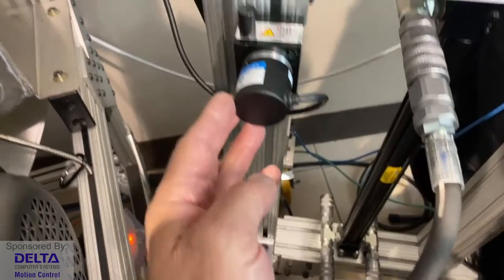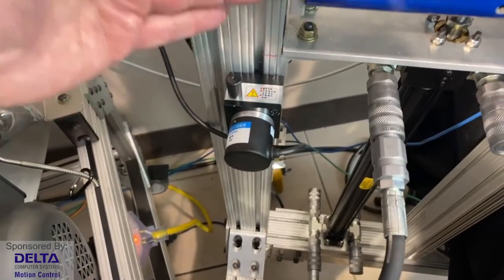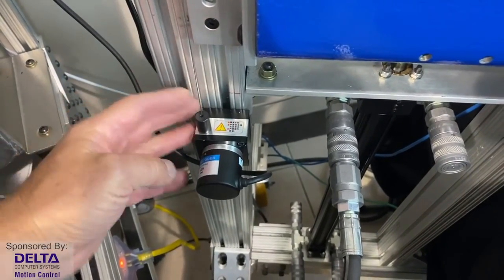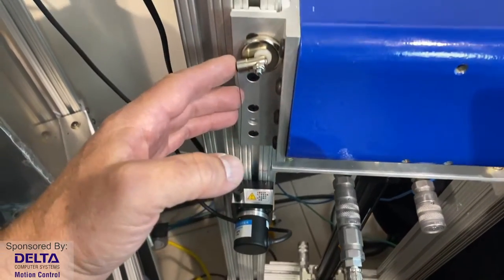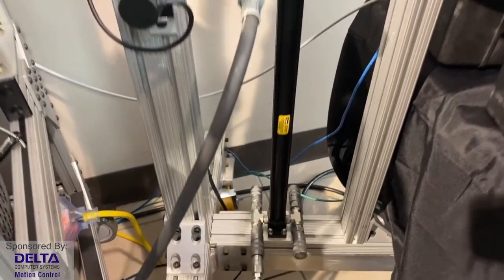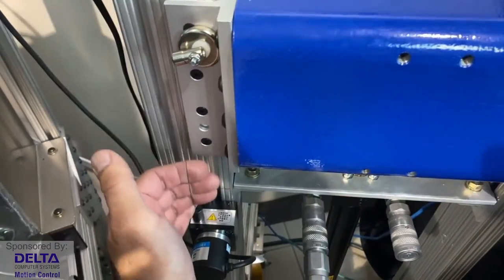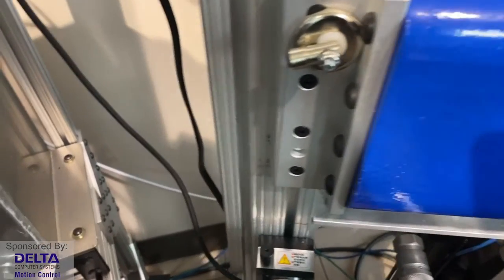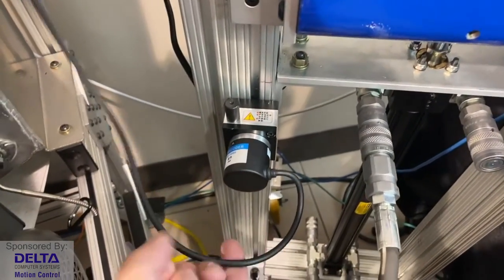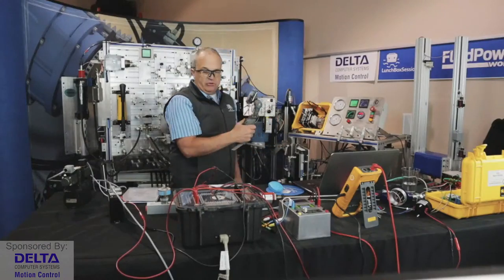So have a look at this particular sensor. It says here that it's a rotary encoder. Well, but it's actually a linear sensor. What you'll see here, it's a little hard to see, but there is a cable pulled device mechanism here that is automatically retracted by the head of the encoder, and we've got it connected by a magnet to a steel block that's going to move here. The 1-inch cylinders that are below here are not really sized well to take an internal sensor. So this was a different application for an external, and that is a cable pulled positioning transducer. Very fine cable being pulled and then spring retracted. And again, we're taking a 4 to 20 signal into our control system, and we're going to be using that one in a moment to see some very interesting motion control problems.